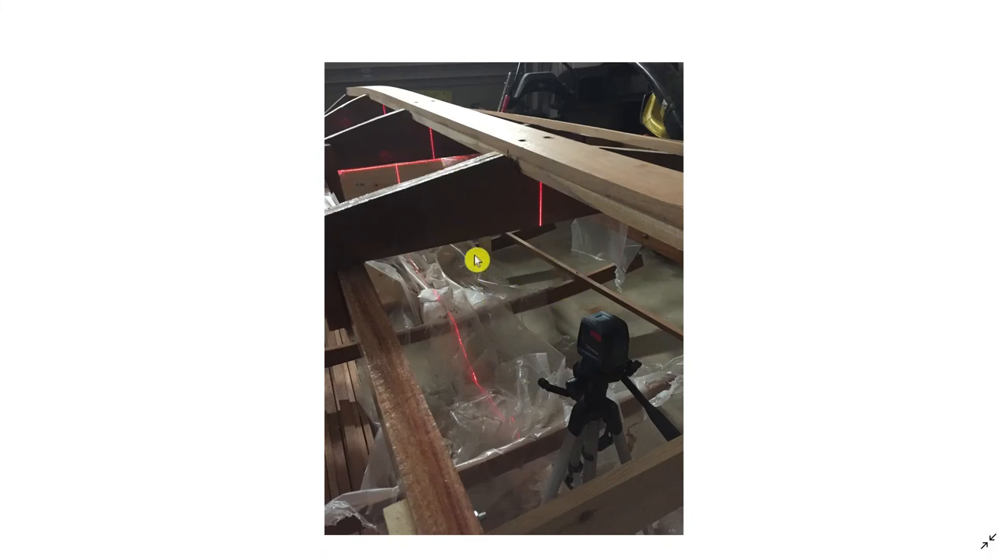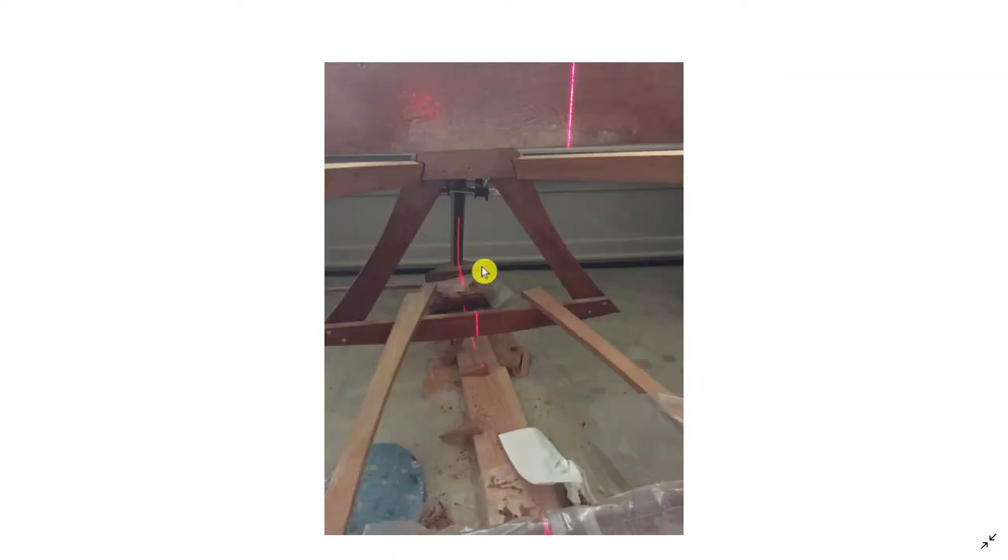Here's another picture of the port side first lamination. I'm checking that the stem in the front frames is centered, using a laser to verify it's still in the correct position. It doesn't have to be perfect, but I want to get it close, because when you do fairing on the outside of the stem you can adjust. You can also see the temporary braces from scrap pieces helping to stabilize things. Frame 8, the stem, and the breast hook are attached to the building form, but I still wanted to verify everything looked lined up.